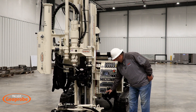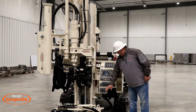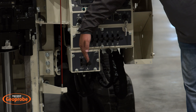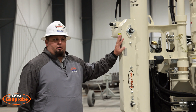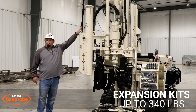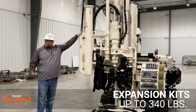Down below here, this machine is equipped with the optional seven-inch breakout clamp and wrench. Your controls are down here from your clamp to your hydraulic powered wrench. Next we'll move to the features of the mast, starting with the optional DH-103 automatic drop hammer. This is an option and it comes with a 140-pound slug, with other weighted slugs available per your preference.